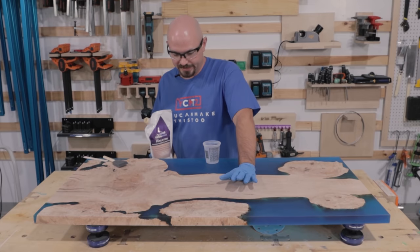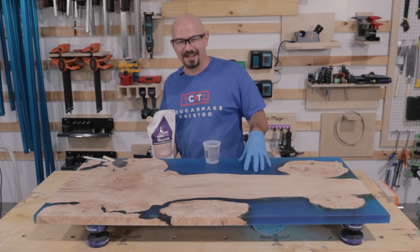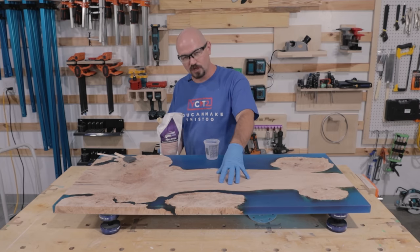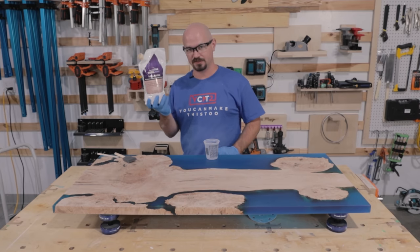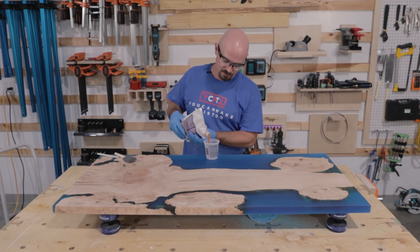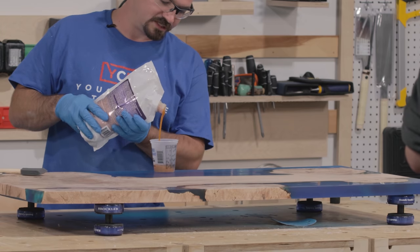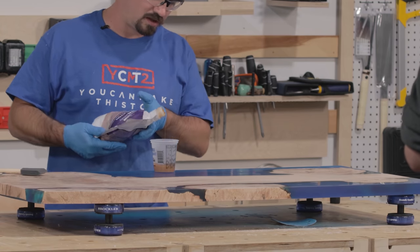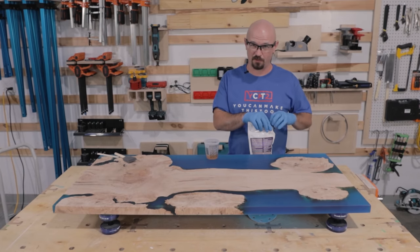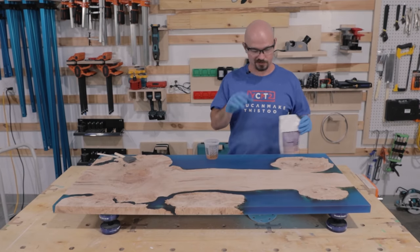One of the things though is I don't want to yellow this beautiful blue tint at all and make it green, but I do want to tone the wood. The way I'm going to do that is using Total Boat Amber Halcyon in gloss, but this is a really thick finish because it self-levels, which is a great quality, but that kind of fights against me. You don't want to treat this like a wipe on, wipe off kind of varnish at all. It's just not going to go well.